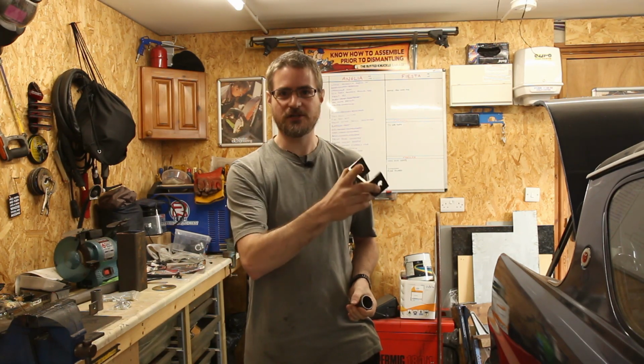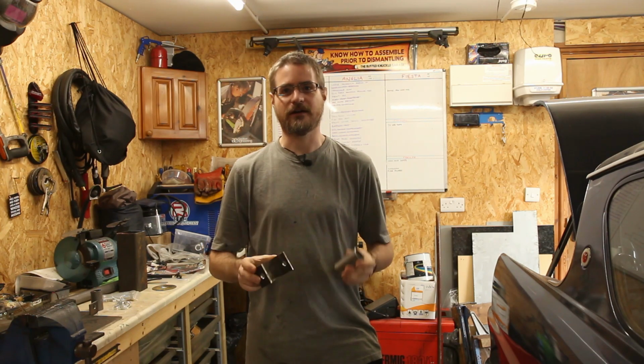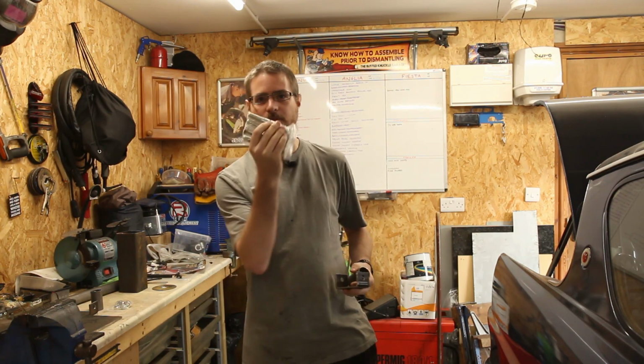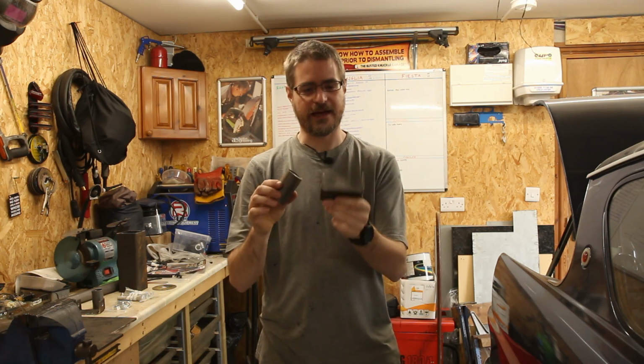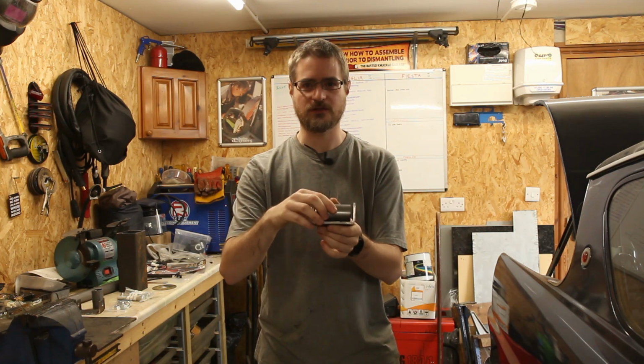If you were watching last time, firstly thank you very much, and if you weren't, we were busy making up some new engine mounts based on a design from the skid factory down in Australia to remount this Mitsubishi engine into my Anglia. And I left you because I needed to get hold of some longer bolts, which I now have, and I was also awaiting the ability to get down the country and pick up a lathe, and that will allow me to turn these down, get these edges that I've cut with the grinder nice and smooth and straight, and that should mean that they will sit into here much nicer once we finally add in the polybush. So let's get over to the lathe and get turning.